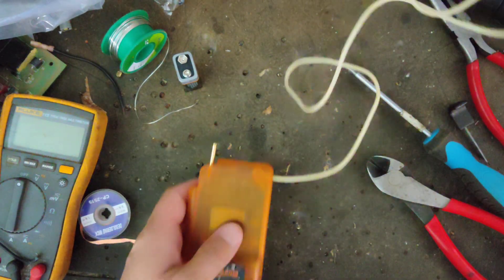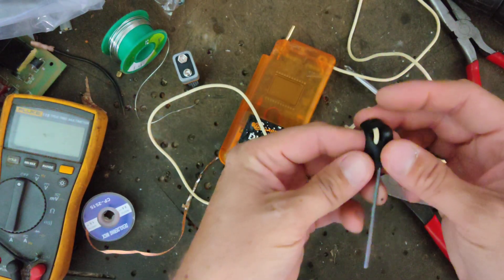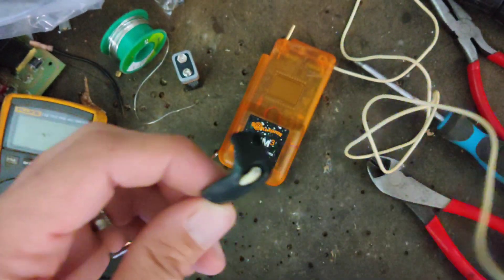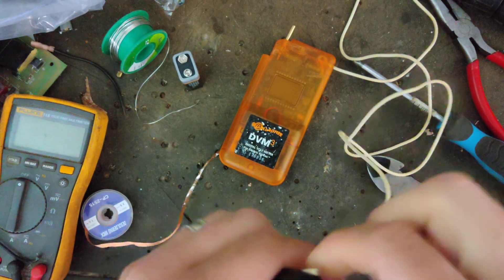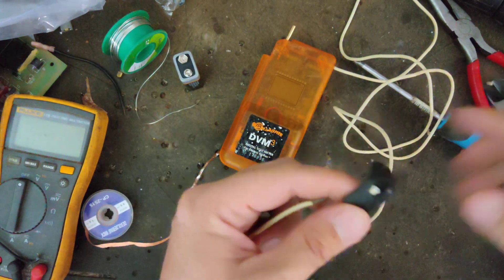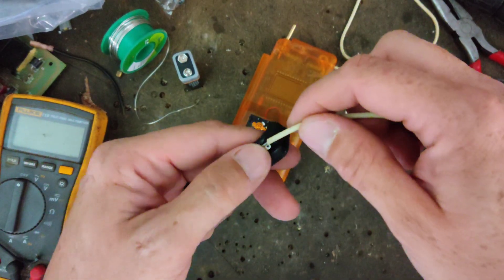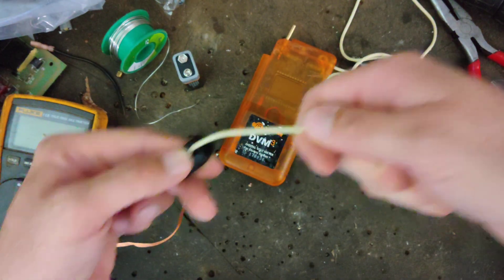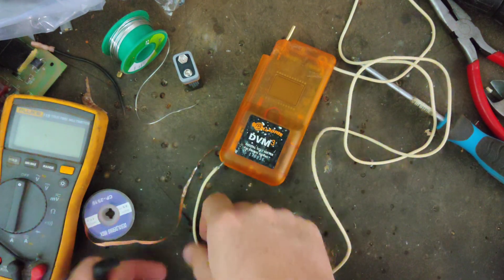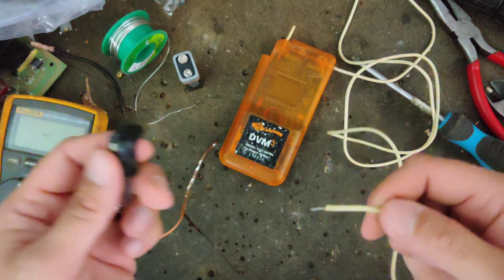We'll hook it onto a known good fence charger and if it doesn't work, then we've got a bad board inside. But this will teach you something. So that's where the wire used to go — right inside there. It's kind of pressed and pushed into place, and over time they'll break or come loose. When you're using these things and you press the probe into the dirt, don't grab the cord to pull it out — grab the actual ground probe itself and pull it out. Because over time if you pull the cord, eventually you're going to pull it right out of there, especially in hard ground.